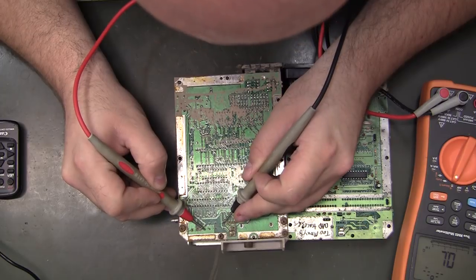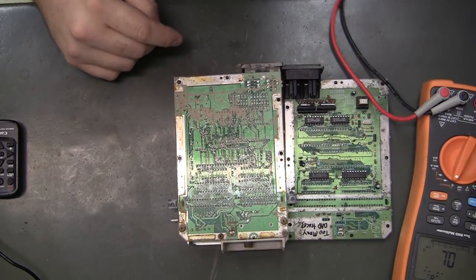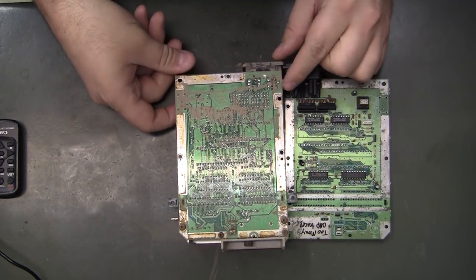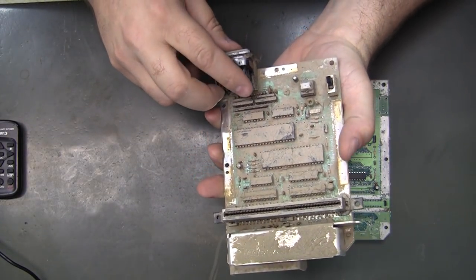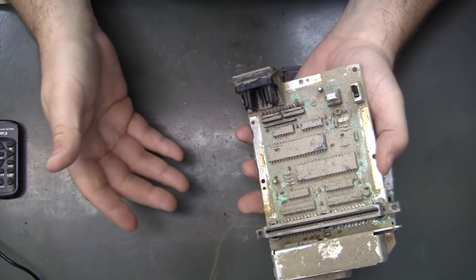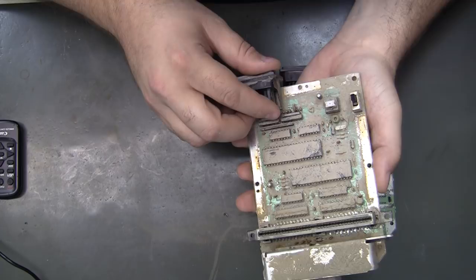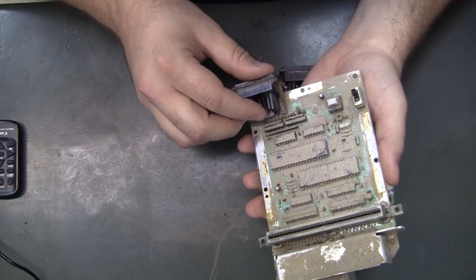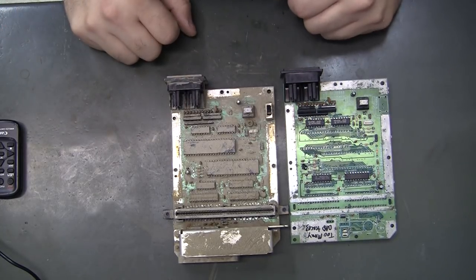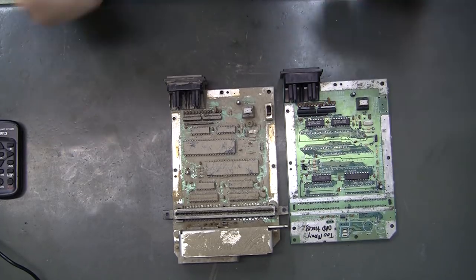It's just not there. So technically I could solder a wire from here to here and go a little further with it. But do we want to do that? Kinda, honestly. But it seems like a bad idea - I'm sure this is all dry now, but even just a little bit of residual moisture could cause major problems if these chips are still in good shape. If we vote to clean this thing up, I don't want to burn them out now. I'd rather clean it up first and then try all that. My vote is to clean it.